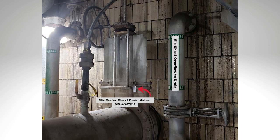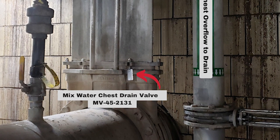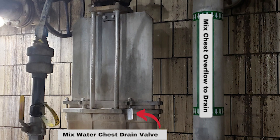Large manual or automatic valves are often serialized and will probably have a tag or name plate from the original equipment manufacturer. It's also useful to attach your own labels that indicate the equipment number and name of the valve. Clearly identifying valves is important for lockout-tagout and day-to-day operation of the plant. Make sure the attached labels don't interfere with the operation of the valve, so labeling the piping adjacent to the valve is often your best bet.